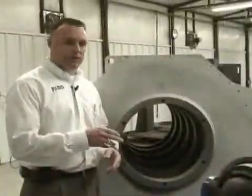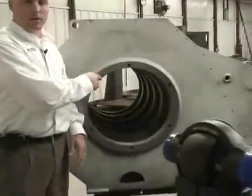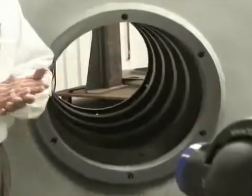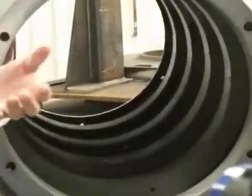One of the key features on these frack pumps is to determine the concentricity from one end of the pump to the other. You've got six diameters that need to be concentric within two thousandths of an inch. With conventional hand tools that's very difficult and cumbersome. With the laser tracker we can do that in roughly three to five minutes and get very accurate measurements within one thousandth of an inch.